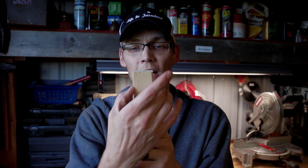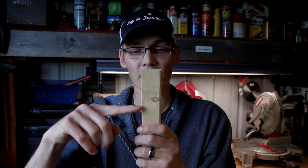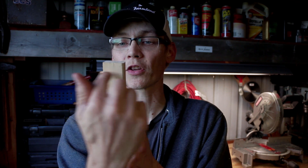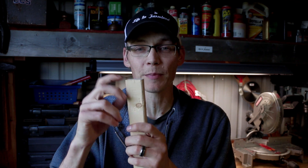To build the spacers I'm just going to take one of these strips — since they're not a full two-inch dimension, a one by two is actually an inch and a half — so I'll come down an inch and a half, lop that off, come down another inch and a half, and cut off a bunch of these. Then as I get them attached to the cross piece, I'll turn them so the grain is going the same way as all the other boards, and I'll use an extra one as a spacer to make sure all my spaces are set. One last tip: try to find the ugliest, most twisted piece in your pile to cut up these little spacers, since it's just small chunks and no point making that work in the bigger scale stuff.